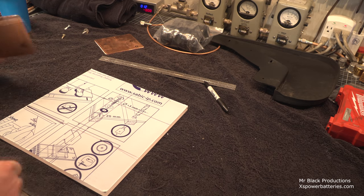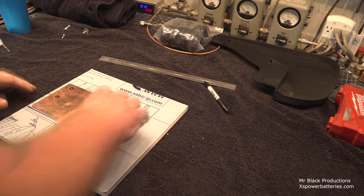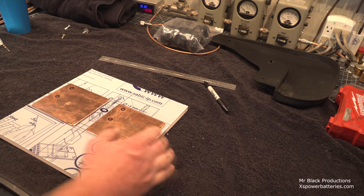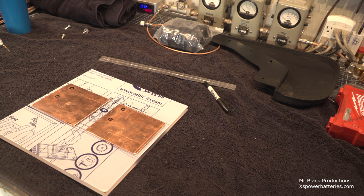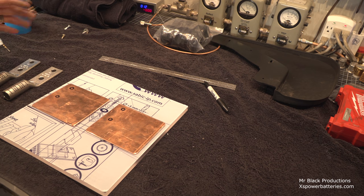I love installs. Okay, so we got the wire up into the cab this morning. We got it run last night due to the great help of my friend Nate. That was no small feat, I'm not going to lie, and that was really a lot of work. So let me absolutely stress that what I'm doing is absolutely not necessary for the amount of current that I am generating. You can easily get away with running much smaller wire. You could run one piece of 4/0 or 250 MCM and be able to get the same results. But this comes down to whose thing's bigger, mine or the next guy's. And I like big, and I'm not going to settle.